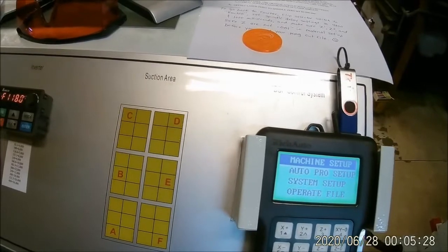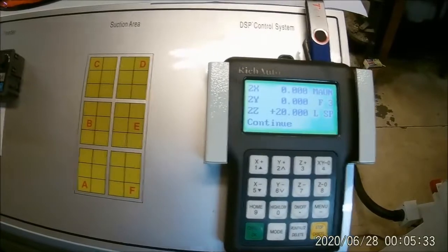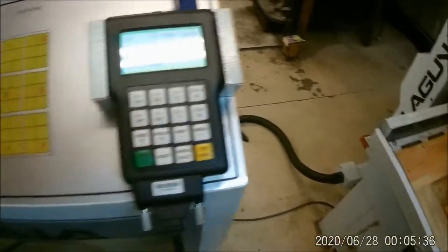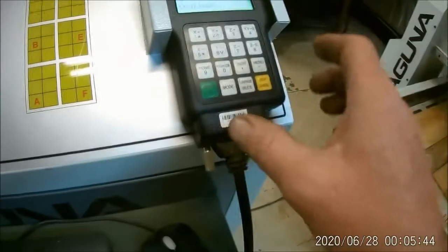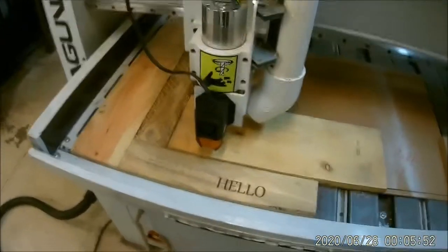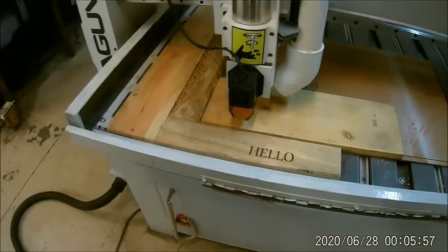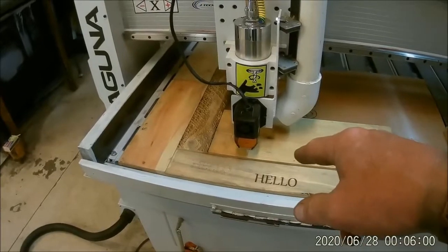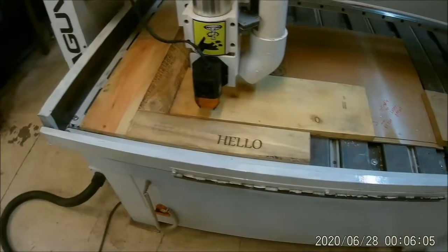Then you're good to go as far as running the laser. You just adjust your travel speeds according to how dark you want it to burn on the wood. One issue that Jay mentioned is that on any of these tables with an HHC controller — where you don't have the computer software running the whole show — you can't turn the laser on at low power to find where your X/Y is going to be on your material.